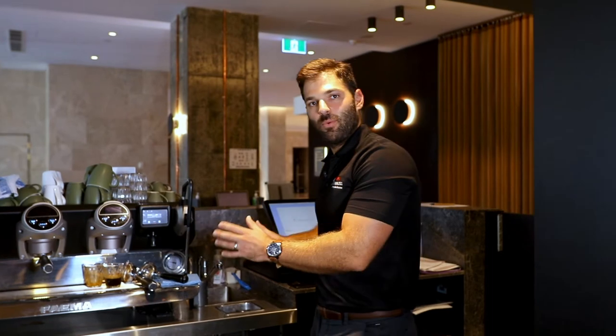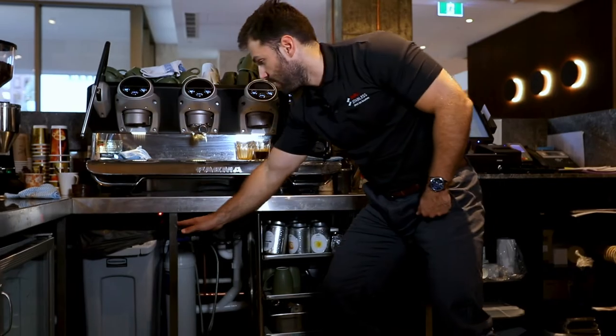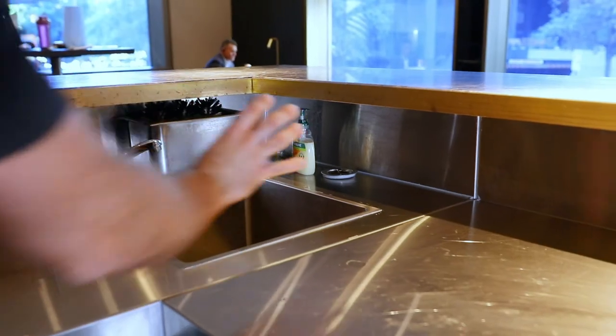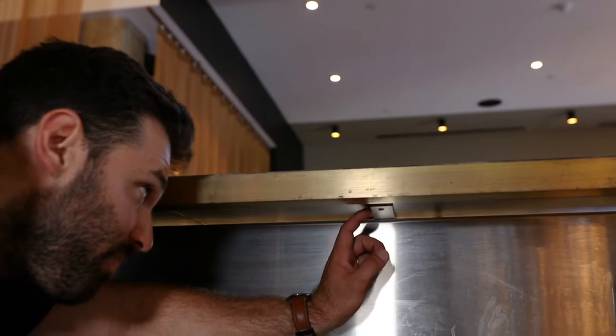This bench is the 2100mm wide module. It comes with three frames which make up the six individual legs. The legs are fitted underneath the worktop to welded angles with the supplied nuts, washers and bolts. The lower and upper cross section bar is then fitted using supplied screws into pre-fitted riv nuts. As this bench is set in the corner, an end panel kit was required to support the servery. These end panel kits come supplied with upstands and serve-over support tubes.